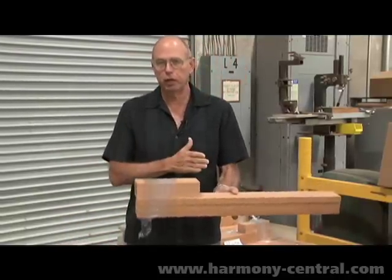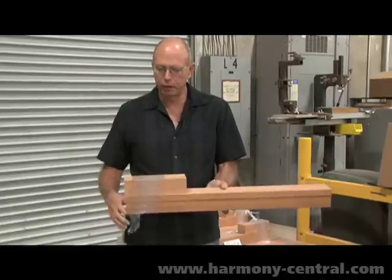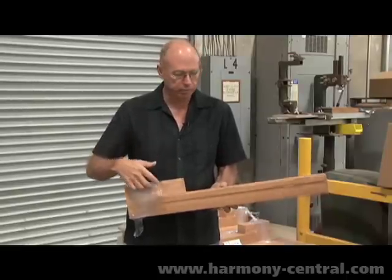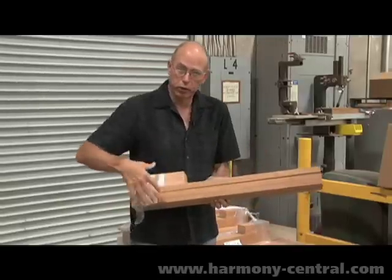This is going to be 3 heels for guitars. So it's the same contiguous piece of wood from this, and it's going to move right back up onto here so that the grain, the nap, the color, the staining all matches. We're going to make a special cut here and get the bend of the neck in. I'm going to show you how that's done.